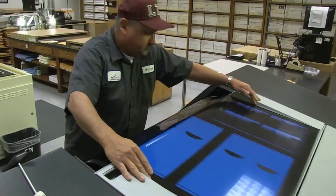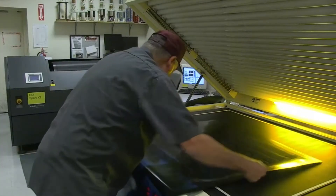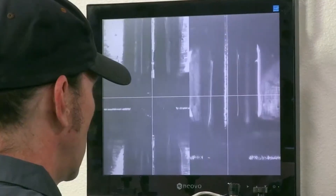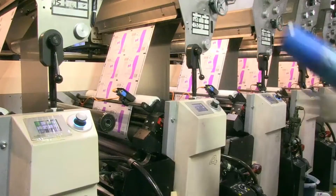This ink is then deposited onto the final roller — the one with the printing plate on it. The printing plate is etched, so the parts that are raised get covered by ink. This then goes round onto the paper with an impression roller to really make sure that the ink is absorbed onto the material. A thing to note here is that flexography can only be used web-fed, which we'll go over in another episode.